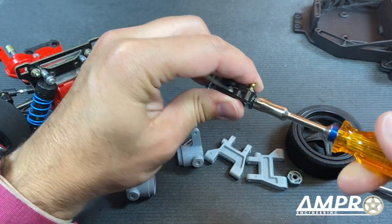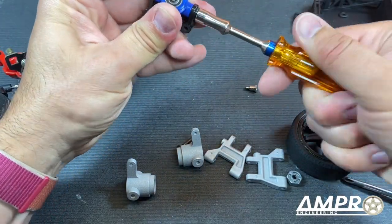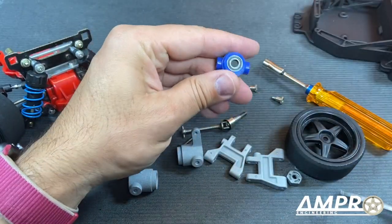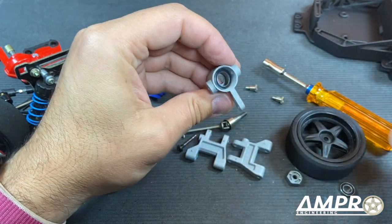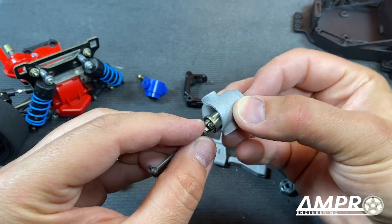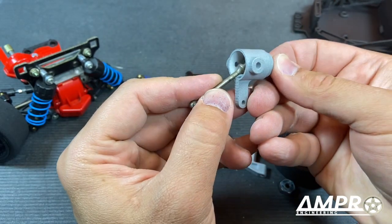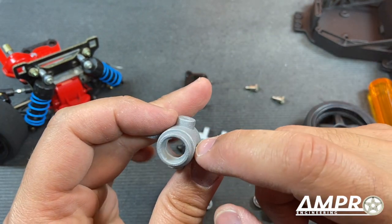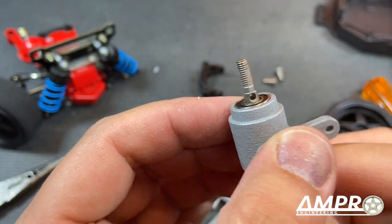We've got the hub off the car. We can reuse all the same parts, including the same ball bearings and axles — the purpose is just to get more clearance around the hub. I made it really big around the perimeter so it should clear. I made a small boo-boo though — I didn't realize that part of the stub axle actually sits inside that hole, so I made the original hole larger than needed. But now we'll push it through — tragedy averted.